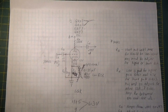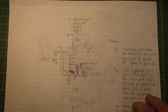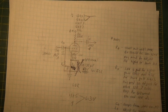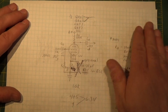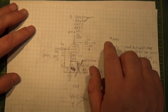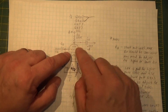Let me see if I can get some lighting on this to make it a little bit easier to see. Sometimes this light makes it better and sometimes it makes the camera over-adjust and makes it darker — it's kind of hard to see on the screen of the camera. So here is a little modification. This is the sheet we used for our tutorial on our little preamp, and this is the design I ended up using for the amp. Now this is one channel — I used a 12AX7 and I did this twice, one for each channel.